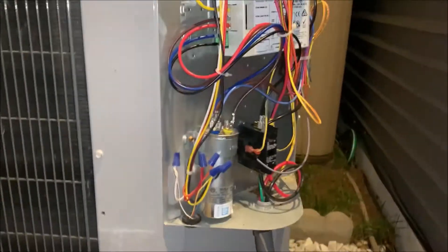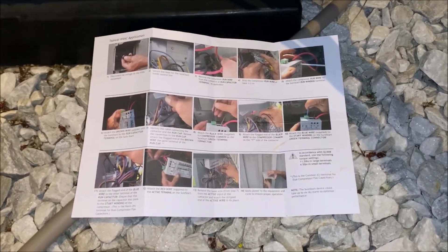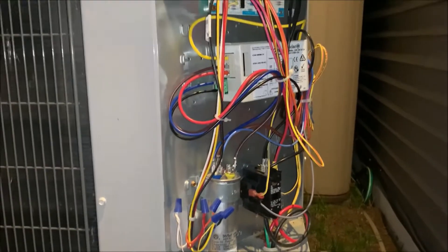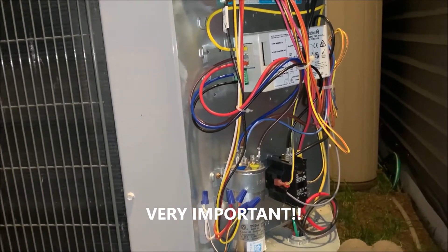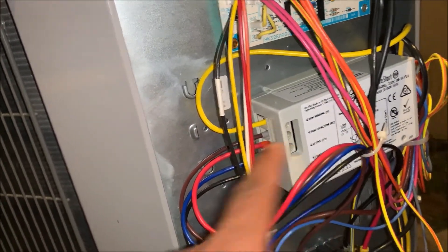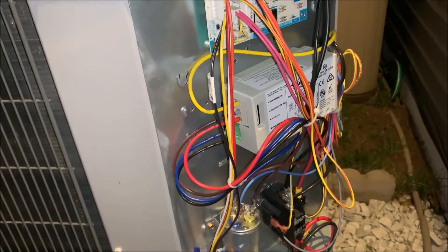The soft start kit is installed — done 100%. I'm so blown away by the difference it made. Sometimes with the camera and the microphone you can't really pick up the sound — a lot of people say the generator is loud; it's not really that loud, the microphone makes it seem like it is. These step-by-step instructions are 100% on point — probably one of the easiest installs I've done. There's a good bit of wires but nothing to be alarmed about. Know the difference between your run and your start off of your compressor — in my case run was yellow. The compressor's got three wires; don't cross the start and the run, make sure you've got those right. Fairly simple install.